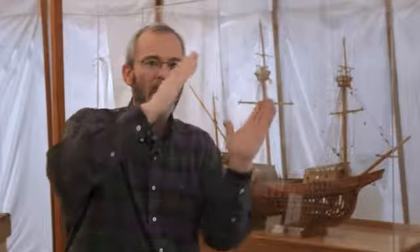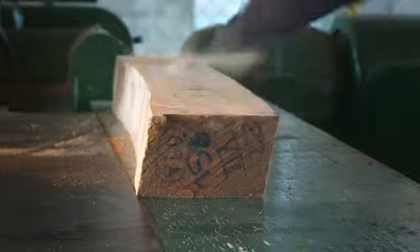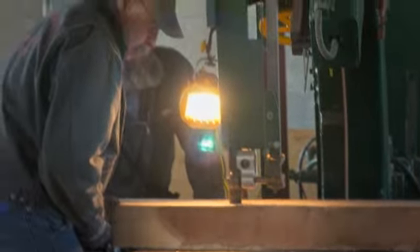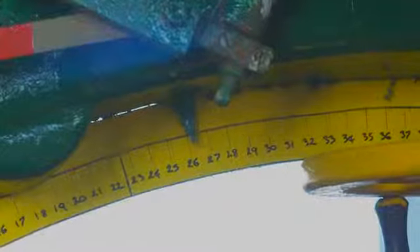The whole saw is a band saw, and the whole mechanism will rotate right around the top of the table — that's what allows us to cut a bevel. It's typically a three-person operation, where you have two people pushing the wood through the saw and making sure you stay right on the line, and another person operating the equipment that actually gets the bevel right.